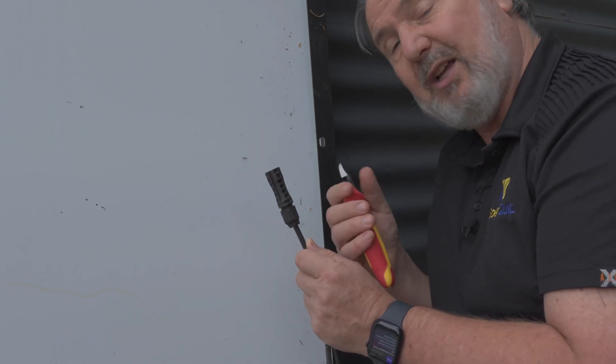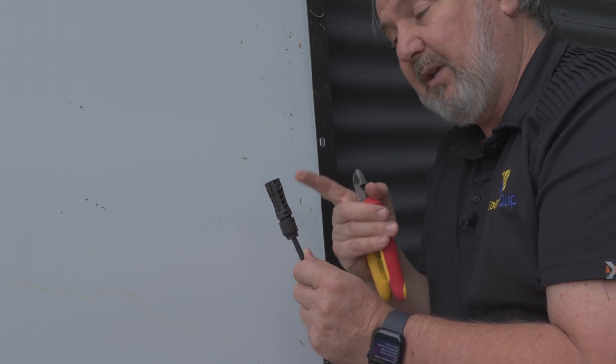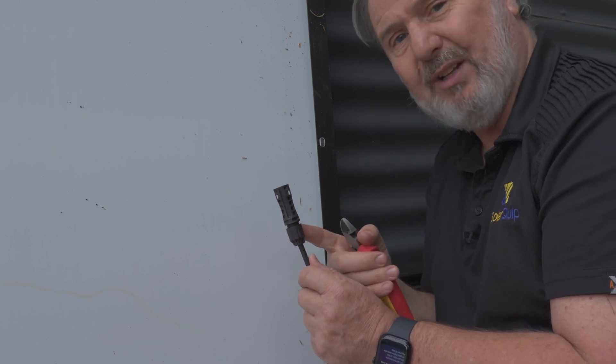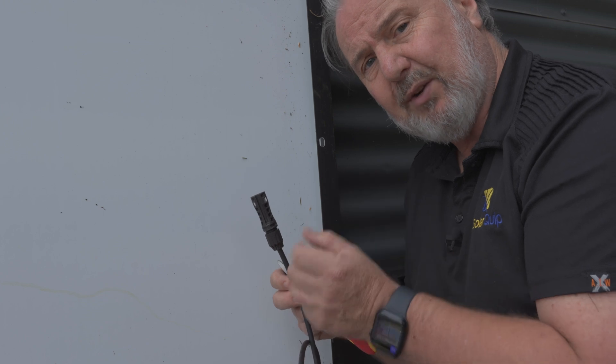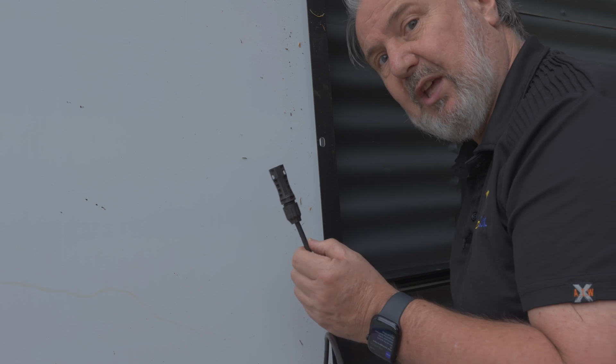That's important detail. It's one of the areas that's really overlooked — the plug and sockets are often the point of failure if they're not matched. Also if the installer making a home run cable has done a poor job and hasn't used the right tools for the crimping and the mechanical restraint on the cable.